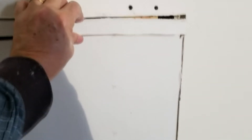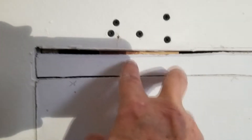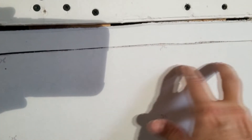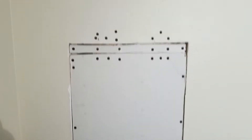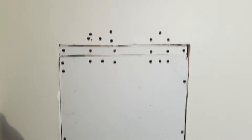So we have our two upper boards in place now and we have enough bracing to go ahead and install our two pieces of drywall. We have the big piece in and now we're just going to put in this one inch piece along the top there. Use your position of those screws as a guide to tell you where your wood is. I usually just keep my screws opposite the ones I've already put on there — a couple here, a few here, a few here. Now all the screws are in and the drywall pieces are in place. Now we're just going to get some green mesh tape and tape around the borders.